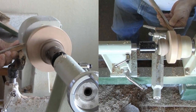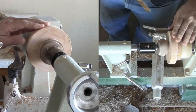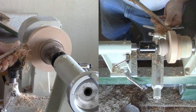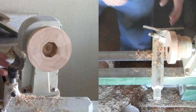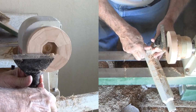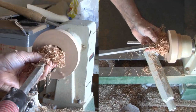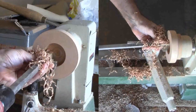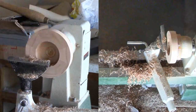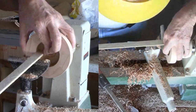I'll start with the large ring using a gouge. I don't have a lot of diameter to spare to insert a four-inch mirror. All I want to do is knock off the points between the segments and round out the piece. Next, I'll face off this ring to make sure the thickness is consistent. I've switched to a square carbide tool. Then I want to cut out the center to allow me to glue in the smaller ring. I'll make sure the sides of the mortise are parallel. I'll use a long scrap stick to sight on, compared to the lathe bed — this longer stick makes any error much more dramatic.